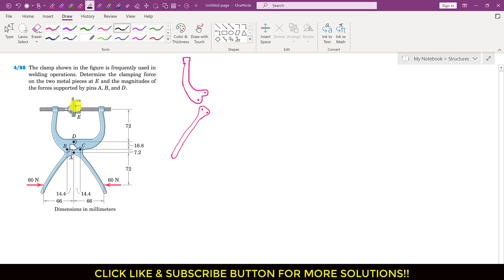We have to find the force which this clamp applies at point E. This whole mechanism will apply the force at point E in this direction. If we consider this part for our analysis, this screw will apply the force on the upper part in this direction. So there will be a force — if we consider this as a free body diagram, we will consider the forces on this member of the mechanism. Here we will have that E force acting on this member. It is given that a 60 Newton force is applied in the horizontal direction at the left handle, so here we have that 60 Newton force.